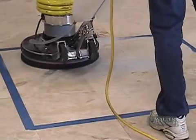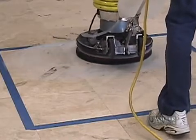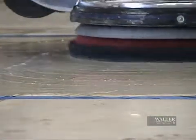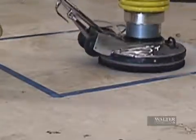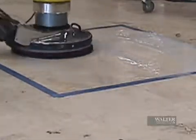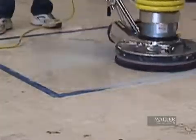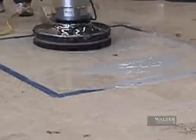The Norton Diamond Disc pads use a patented cultured abrasive that is blasted with the sonic process to fracture the abrasive crystals. So when you are using the Norton pads, the abrasive breaks off, repeatedly giving you a new fresh cutting edge that allows you to get the square footage that we described earlier. Normal abrasives on competitive pads will become dull and rounded, giving you only a few thousand square feet of coverage or requiring a liquid lubricant to keep the pad from overheating.